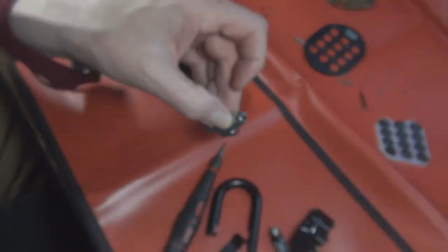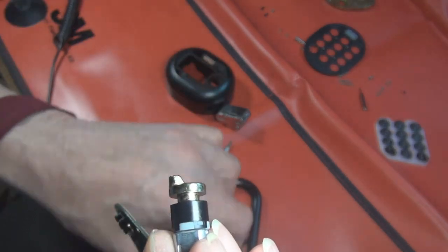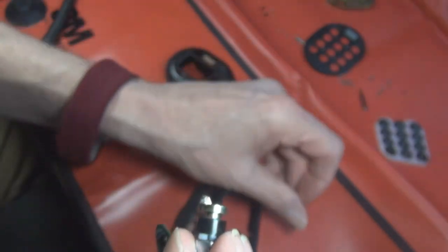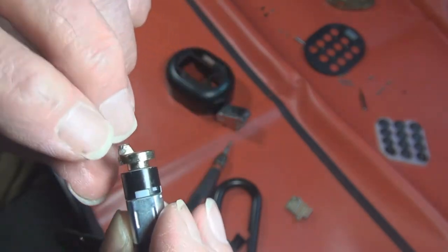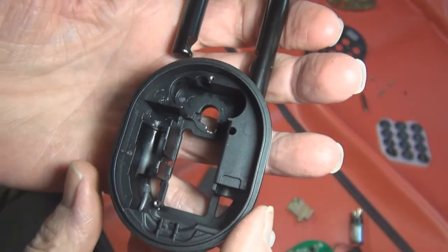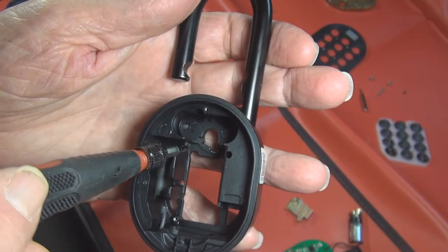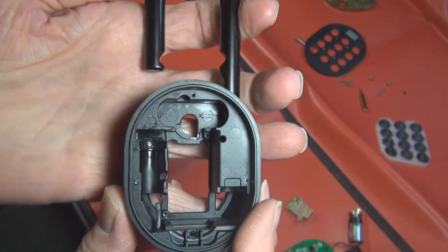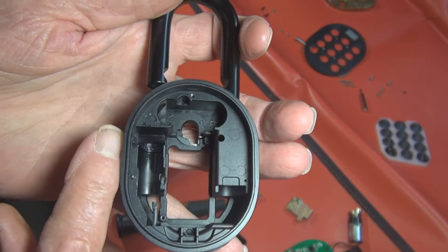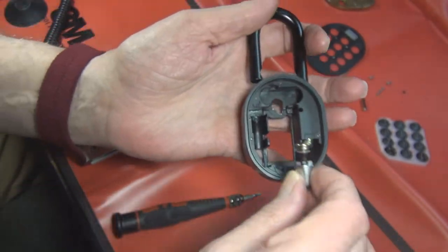So what does the motor do? The motor has this little arm on it that goes over and energizes the locking - it pulls on that little bracket, sits in this little slot, and it rotates and pulls this in or out. The motor has a little gearbox inside - it takes quite a few revolutions to rotate this about 90 degrees. This is where the shackle goes, this little pocket is where the motor goes, and this slides along through here to pull the shackle back.